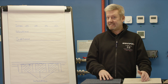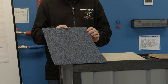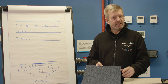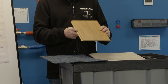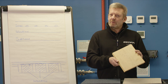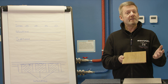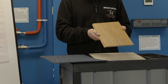Carpet and timber are both insulators. If your customer chooses carpet as their floor covering, we're looking at tog ratings — maximum one tog underlay and 1.5 tog carpet. Try not to exceed those figures, otherwise the output will be greatly affected. Timber floors can be anything from a traditional laminate to an engineered board to solid timber. Certain floor coverings like timber will have maximum permissible floor surface temperatures, often 27°C. Always check with the manufacturer of the floor covering if there are any limitations when working with underfloor heating.